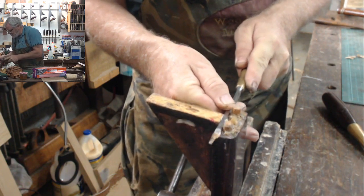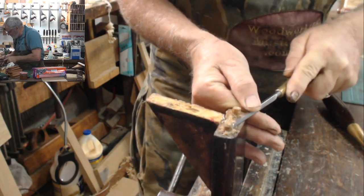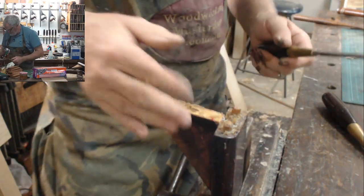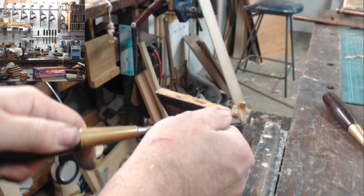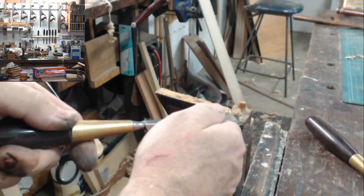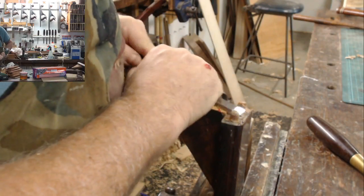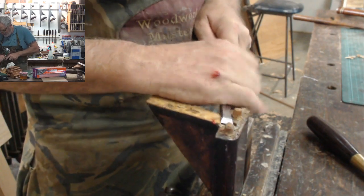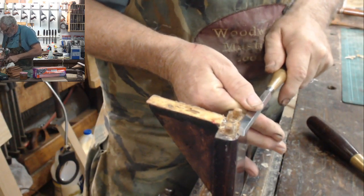But if you clean this up, a really nice sharp chisel helps so much. Yeah, okay, you are scraping, but if you're using a blunt one, you're going to be going everywhere. See how they glue there? There's tons of it. There we go. It's missing a dowel in the middle. The water trick doesn't work if there's varnish on the job, just in case you're wondering why I haven't put water on there.